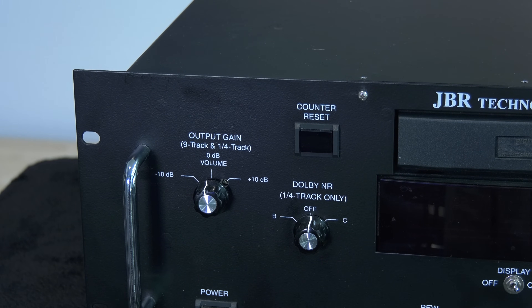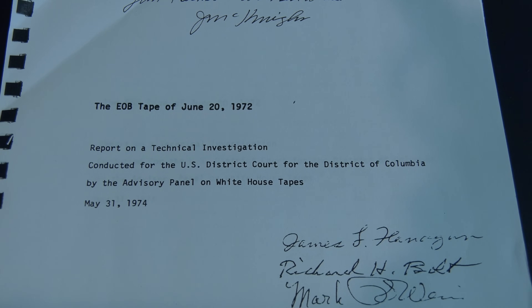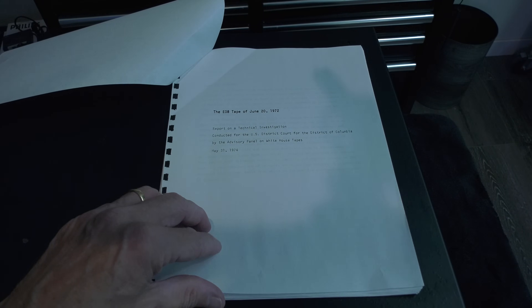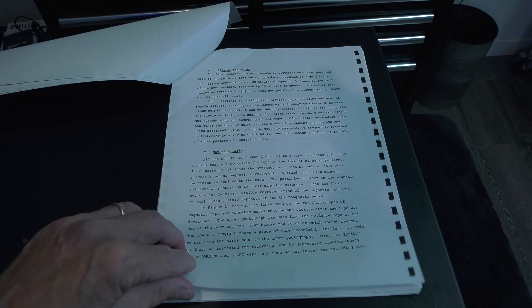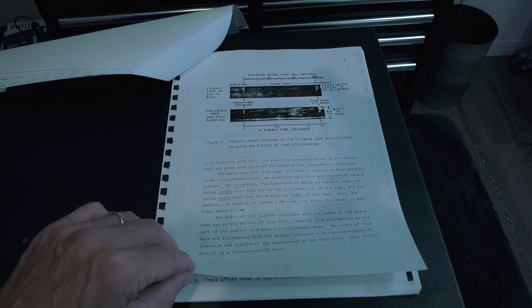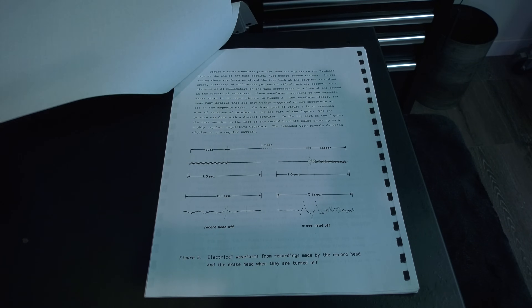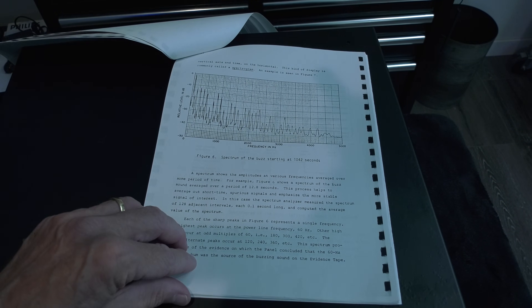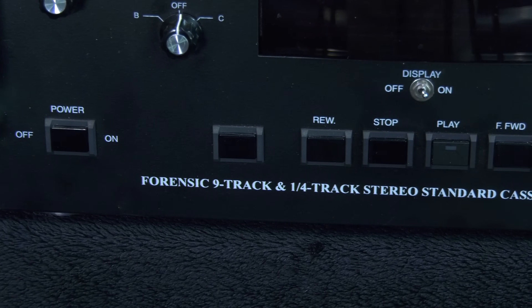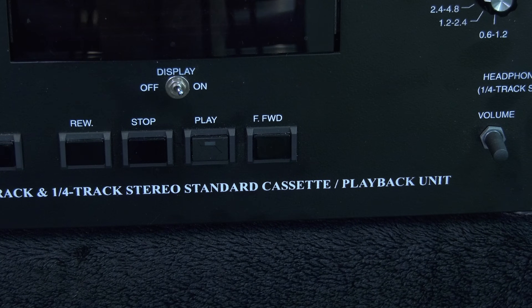There was also an attempt made with perhaps the most famously erased tape in history — the Nixon tapes. We have here the original report from the 70s. In the early 2000s, a handful of companies were asked to try and solve the mystery around the minutes missing from the Nixon tapes. JBR was one of them. As reel-to-reel was used originally, it could be used in the JBR DCC deck, but JBR Technologies proposed a development of a 200-track magnetoresistive head based on the DCC thin film technology to be able to read the reel-to-reel tape. The budget for this was not approved. None of the companies were successful for the simple reason that the original tape remained in the vault at the White House, and the companies were only given a copy. It is impossible to regain any material from a copy.